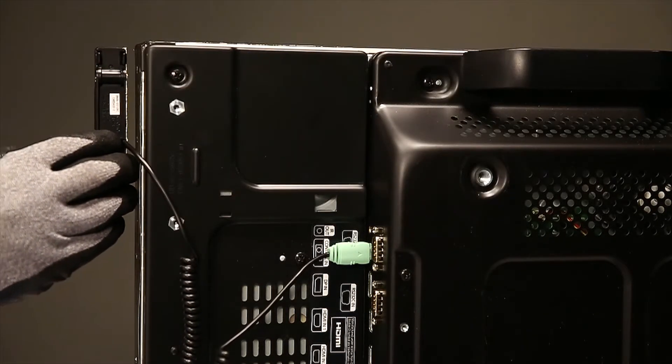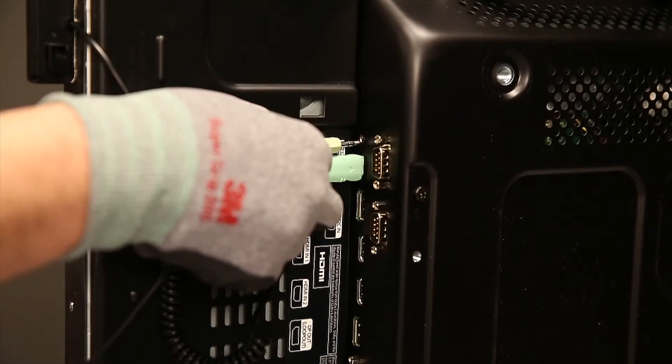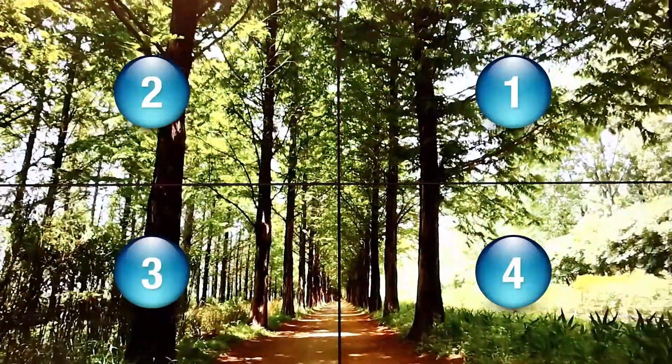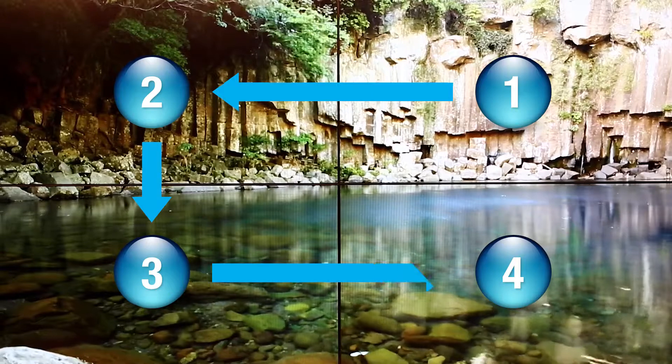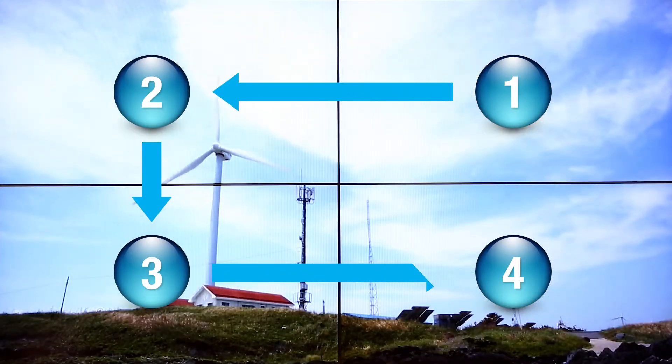Then, if necessary, you can connect and then mount the external sensor kit like this. Let's learn how to make a connection between the LFDs. Connect a video source using a video wall digital loop out. What is digital loop out? A function to input a digital source to a video wall using a DVI or DP cable between monitors without additional equipment.